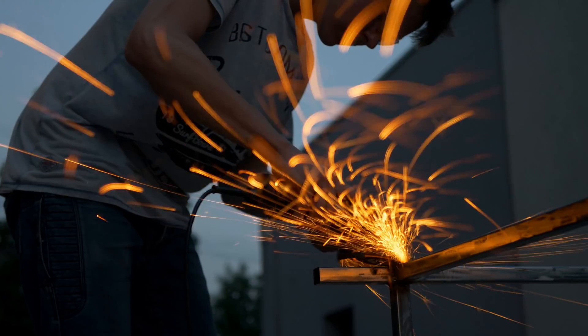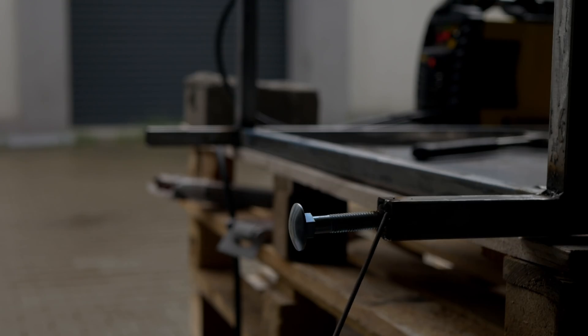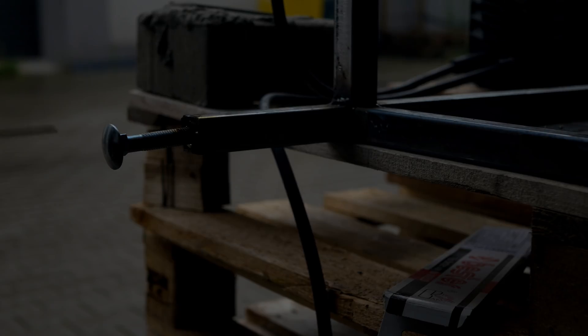The dimensions of this table are 70 by 80 by 90 centimeters, and that's something that works for me. If you need something smaller or bigger, just build it accordingly. One small tip: I always weld four nuts on the bottom of the legs so I can screw in a bolt, and that way I can easily level the table even on a pretty uneven workshop floor. It's also great if the leg lengths are slightly off — usually by one or two millimeters — and I can easily adjust with the screw on the bottom. It's a simple thing but actually pretty useful.